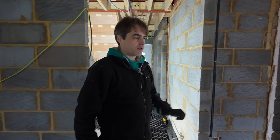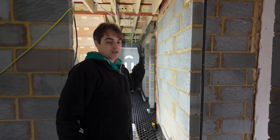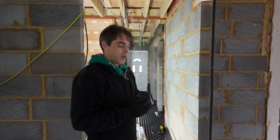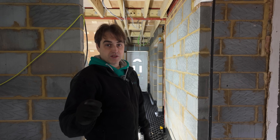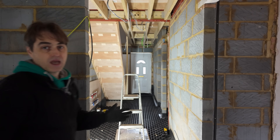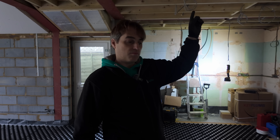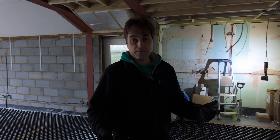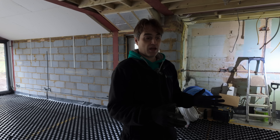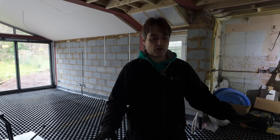This internal space of the kitchen — because those are internal walls — is going to be 200 centres. The bedroom is going to be 250 or maybe even 300 centres because there are internal walls everywhere apart from one wall. The bathroom is going to be 100 centres because of ventilation losses — there's an extractor fan, so we need to provide a little more energy through that floor. Bathrooms are designed to 22 degrees, not 21; bedrooms are 18 degrees. So we vary that pipe spacing throughout the ground floor.